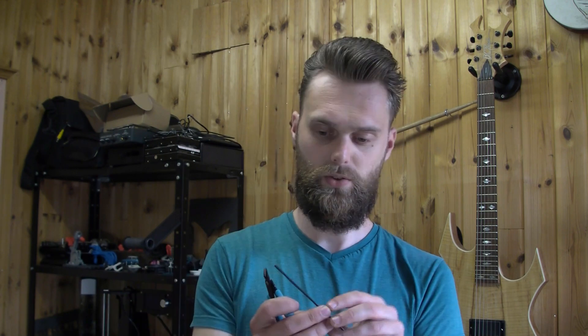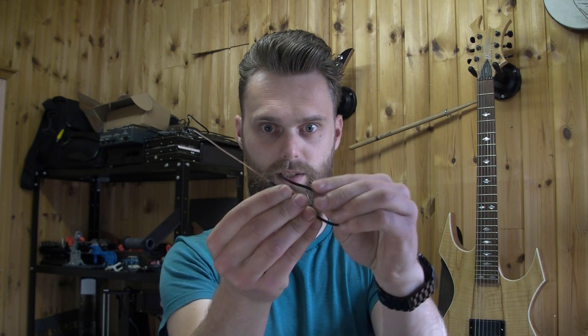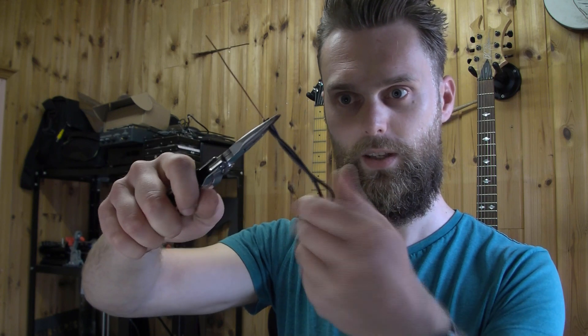The idea is I found some copper wire with a solid core. If you straighten this out and you get a wire cutter, you have to strip 80 to 100 millimeters. Fold this with normal pliers — you can just hold it here and twist it. And then you have a very simple unclogging tool.